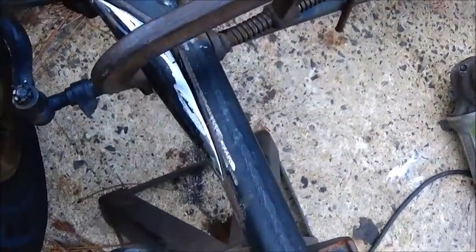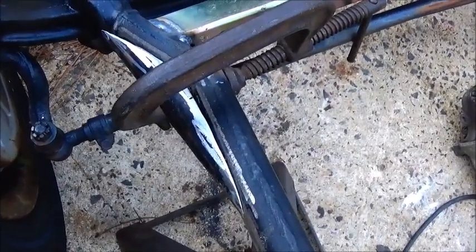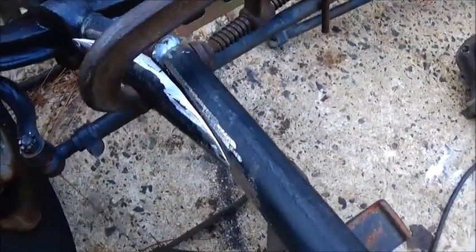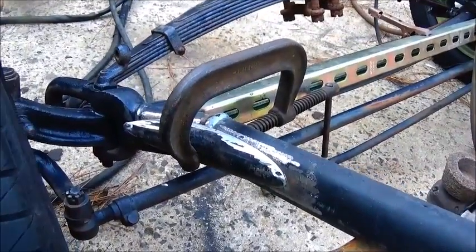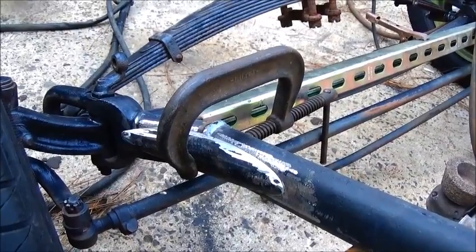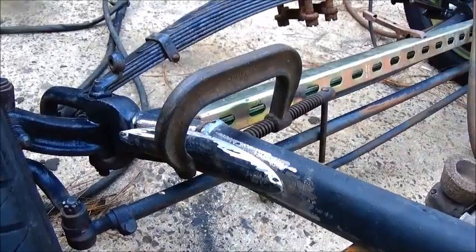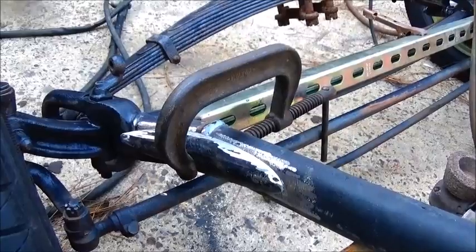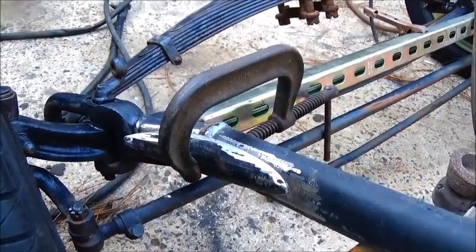I remember when the lowrider started back in the 90s. 90s and 2000s I guess, but I remember some guys that would come by my shop, and they had cut the back half of their truck off, and they redone it with, you know, 2x3 or 2x4 square tubing, or rectangle tubing. And I've seen a lot of spots where they would butt the stuff up close, weld it, and then grind it off. And then they would be wondering why they was getting cracks and breaks all over the place.